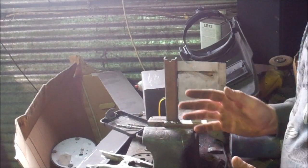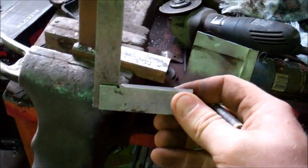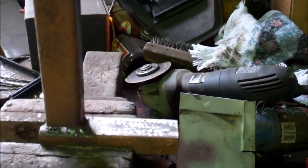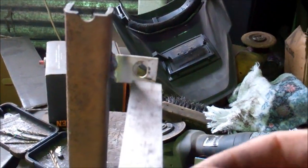What you're going to need to do is find a square. Here I got my square — it's hard to line up because of my weld bead there, but if I lay that flat on there, it's pretty good. The method I'm about to show you doesn't need to be a perfect 90 anyways. Even if the frame's not on a perfect 90, it doesn't matter, because all we're working with is this piece of metal and this mount.